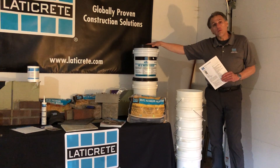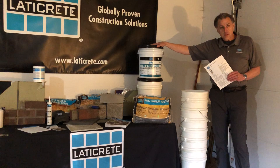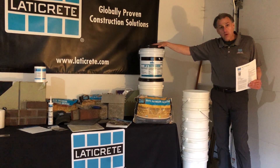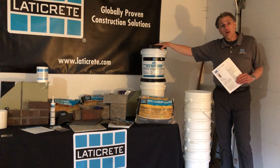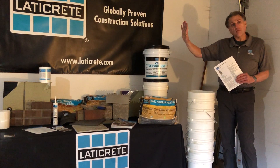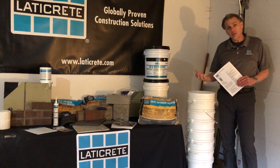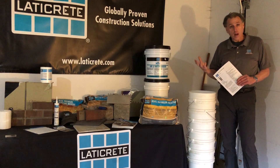This is a cold fluid applied — think of it as a bulk water management system for masonry veneers. Anything ranging from thin brick, to cultured stone, to natural stone thin veneer masonry installations. It goes right over the front face of our substrate, anything ranging from a traditional lath scratch brown system, to a cement backer board, to solid CMU or concrete masonry.